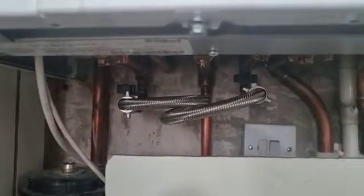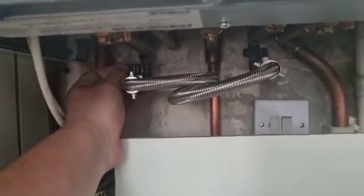We need to put water inside your pipework and your radiators using this gauge, and this gauge needs to be in between these two lines — the two lines that say bar, here and here. We need to top this pressure up in between those two lines. To do that, we go underneath the boiler to what's called our filler loop on a Pro 28 boiler. We've got two black taps underneath.